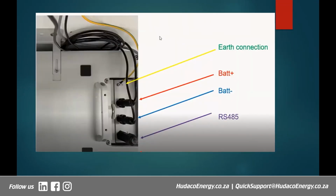Right. This is what the connections will look like on the switch gear. You've got your earth connection, which is that yellow-green wire. And then you've got your battery plus and your battery minus, and then your RS485, which is the comms cable. So it will look like that.